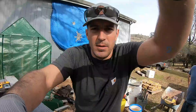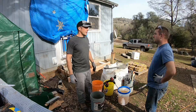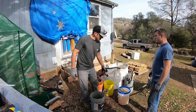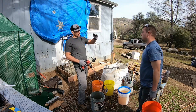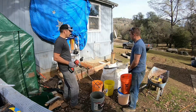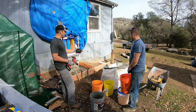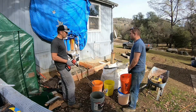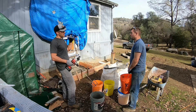You're watching the efficient way to mix concrete by hand using five-gallon buckets. I need this to be more liquidy — no, you don't want it liquidy. There are different what they call slumps or viscosities. The slump test is when they pour the concrete out into a special cone shape, and based on how much it slumps when they pull the cone off, that's what's engineered and specified for that application. This is about 700 pounds at most — nothing crazy. This is 3,000 PSI concrete. If you add too much water you risk the strength, and too little makes it hard to work with.